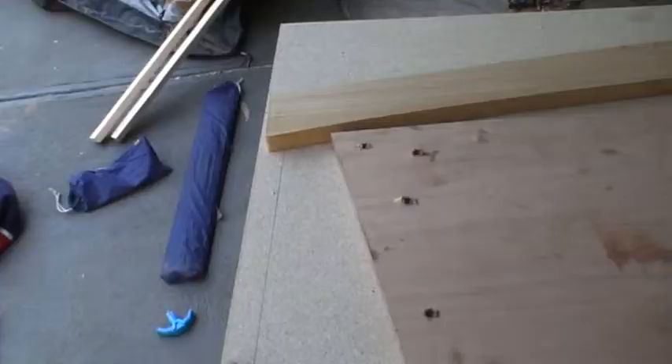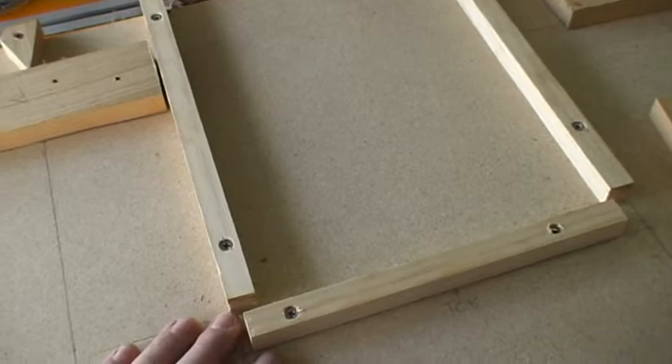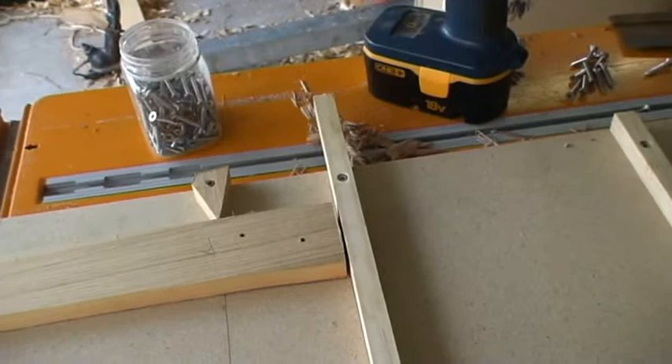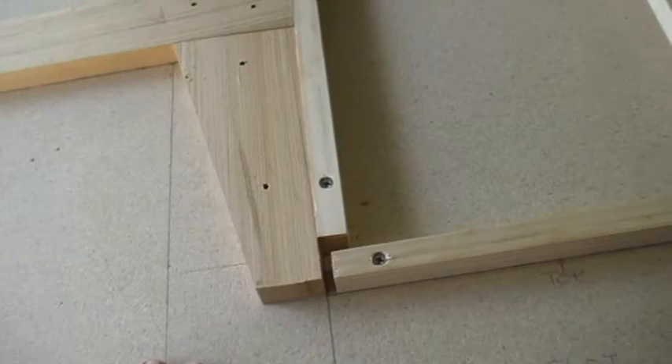The base has been cut over for the curve and I've done that off my jig. We have a transom here, and stations 4, 3, 2, 1 in the bow. As you can see, I've boxed out where the center case itself is going to go — this is the top of it and these are the sides. Now it's just a matter of getting our girders that we've cut off our templates and pushing them hard up against those stops.